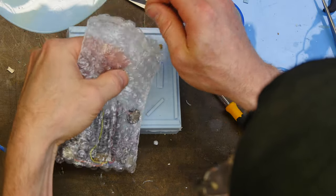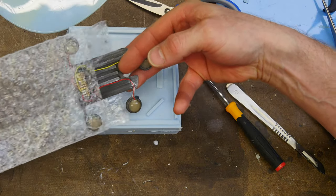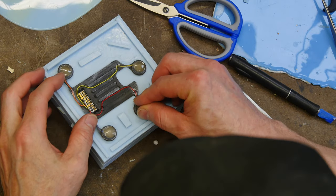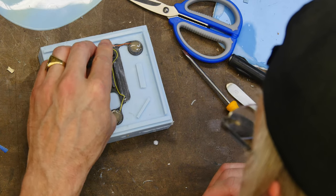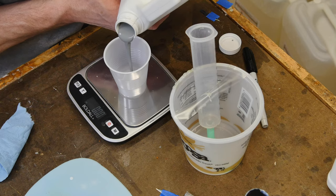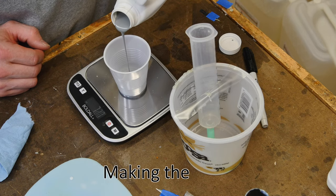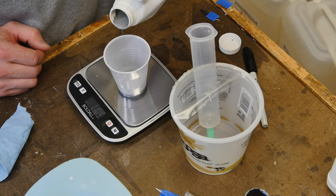This is how the parts come from the client — in a little baggie. They're handmade boards with soldered-on terminals. We're going to snap them into the back half of the mold onto those wooden pegs through the modified mold, and we cover the metal contacts with the little cover. Let's make some parts — again Hyperset 70A from Thermoset Solutions right here in Michigan.